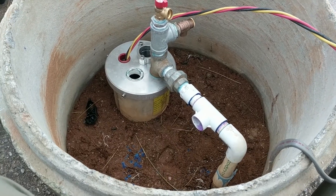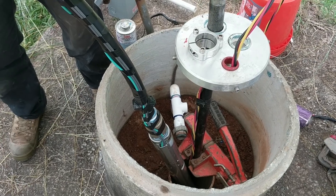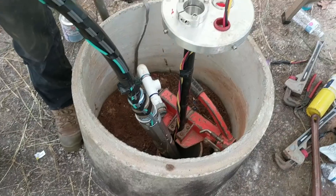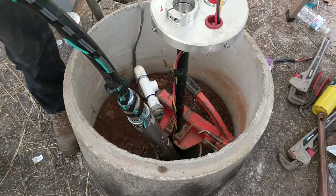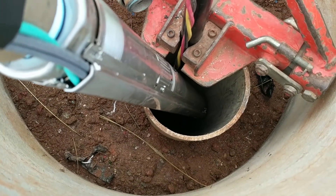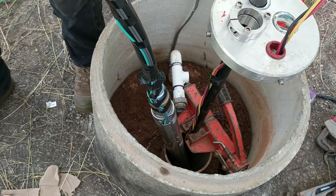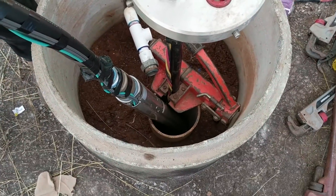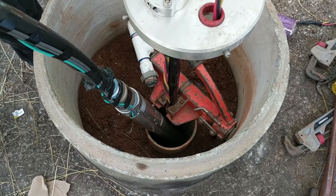Let's continue. We got to get this other pump in there — we're set to do that. We do not need a pump truck — that's what Abraham has decided. We can just pull everything out and put everything back in. Abraham is holding up two pumps, one in each hand. Let's see how we make just enough room to slide this little baby Grundfos down in with the other pump. Because the six-inch casing can get away with this — you can't do it in a four. So we're going to slide 200 feet of this into our well. We've already pre-measured everything and we're stacking everything.